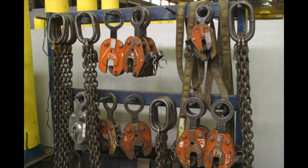When using any under-the-hook devices such as side hooks, sheet lifters, straps, etc., always be mindful of your hands, feet, and body placement. Be sure to use dunnage that leaves enough clearance to safely land material. This will also ensure that the device can be removed without incident once the material has been landed. Listen for the crane operator ringing his warning bell — it's your responsibility to get out of the way.